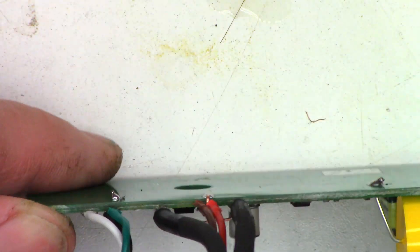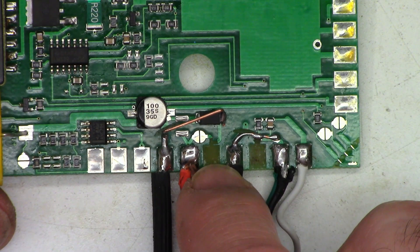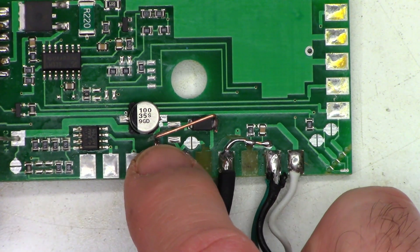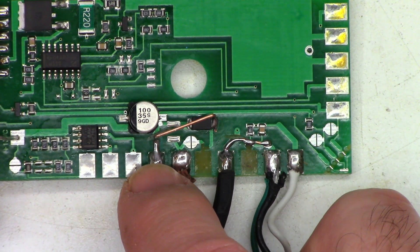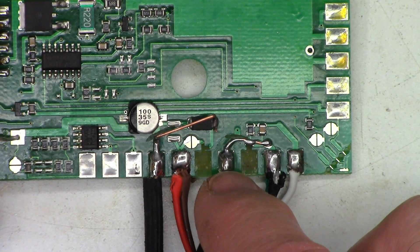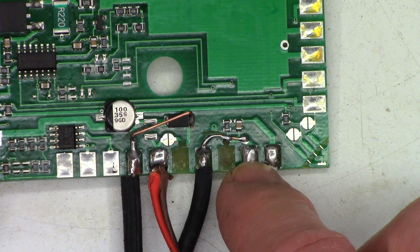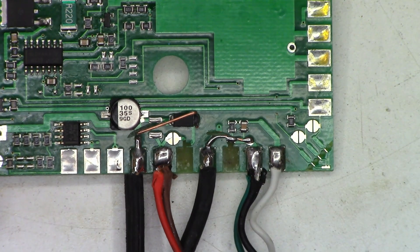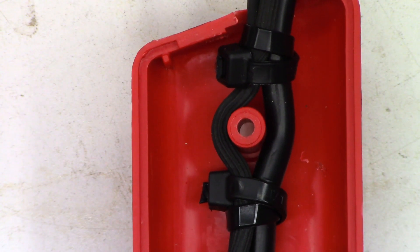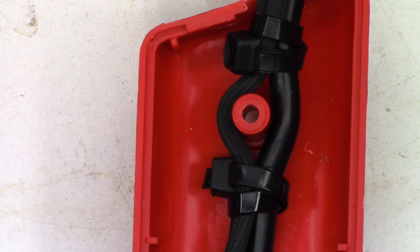Now for the bottom of the board — much, much better. What I did is because this little plate-through that you can just barely see right there is damaged, I went ahead and ran a jumper wire all the way across to that solder pad right there because that little plate-through was defective. And because this trace is lifted off the board — it used to go to the input blocking diode — I went ahead and put a jumper physically on top of everything and ran it to this trace, which I cut. So this is now an unused trace — that's now the positive input for the board. I went ahead and ran another jumper here and sliced that trace that goes to that plate-through. Once that trace is sliced, I added a jumper back down to this trace for the negative input. So this is the shield to the inductive pickup and this is the pulse from the inductive pickup. Now we just have to put it back together and test it. And because there's no strain relief whatsoever, I opted to go ahead and double wrap a couple of zip ties around this post so that it's going to be strain relieved as it goes through this hole, so hopefully it won't pull stuff out for a second time.